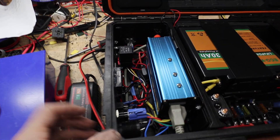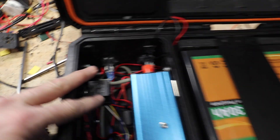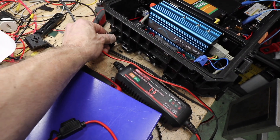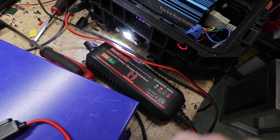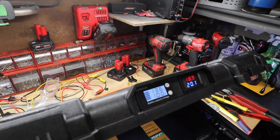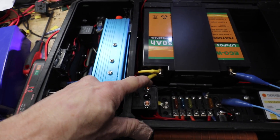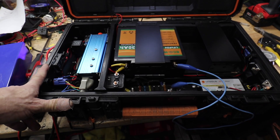I'm a little behind on my camera work so I thought I'd better catch up. I have the master switch installed, the master relay installed. The wiring — not too rat nasty. The relay goes between the battery and the main fuse block. I have my charger installed, plugged into the SAE port on the bottom, and because this SAE port doubles as an output, it's on the switch. As soon as I hit the switch, the charger starts charging the battery. All lights work as they should, all gauges work as they should. Even the little solar switch is working, though the shunt's not hooked up yet. Next up: hook up the relay between the inverter and the battery so I can have a switch on the outside to turn the inverter on.